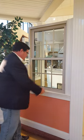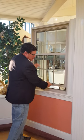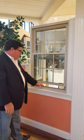First thing you do is unlatch your windows and make sure your locks are disengaged. You want to raise your sash three to four inches above the sill so that your lift rail doesn't catch the interior sill when you tilt your window in.